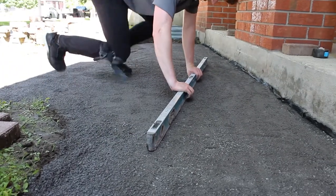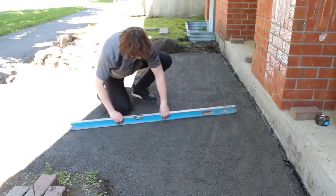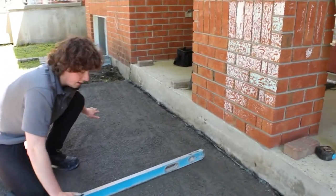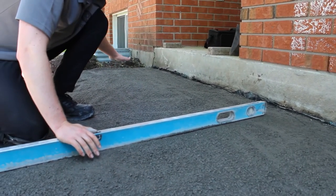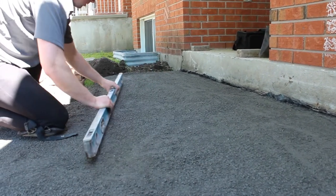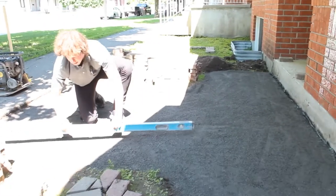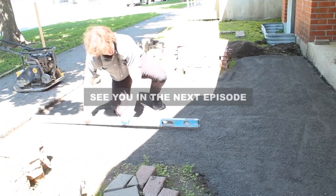Pretty good now. We've got a slope going away from the step, draining down to the walkway. We have a slight crown in the middle, so it's sloping slightly that way. Almost flat on that side, but we think it's going to drop a bit because it's dropped so much over the course of this project. So we're going to compact it one last time when the pavers are on it — that should result in the perfect crown right across there. I'll often keep grading as I go to make sure everything is perfectly smooth, level, and even across. No divots, no problems. So yeah, we're just about getting ready to lay. Exciting.